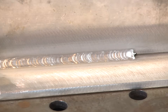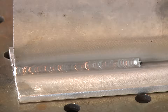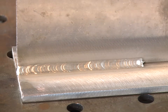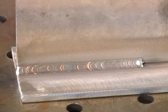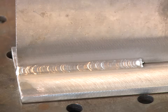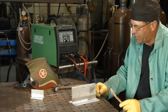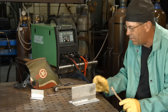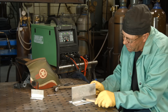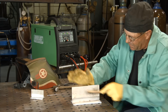I just don't understand why everybody freaks out about a machine not having AC and high frequency for doing aluminum. If all you have is DC, grab some helium — you can make some decent welds. It's something to get used to for sure. You saw me dabbing the wire and going fairly quick. Looks like I jetted forward a little bit right there. This section is consistent, this is consistent. A little thin right there — been a while since I've done this. But things clean up nicely.